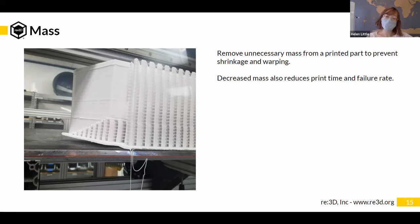Warping is when a part starts to cool as it's printing and it curls up. The part is trying to contract and pull in, but you keep printing hot layers on top of it. The bottom is usually colder than the top, so it's trying to shrink in on itself but it's kind of stuck, so it ends up pulling up off the bed as you can see in the picture. That bottom section was printed directly on the bed but then pulled up as it cooled.